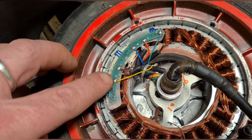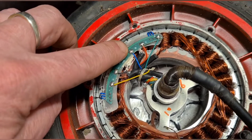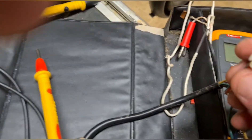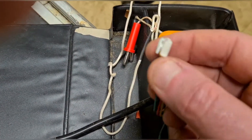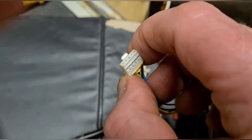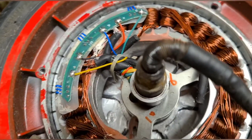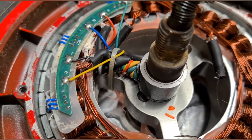Using the multimeter on these five data lines for the hall sensors — the blue wire should match up and give a signal when I touch the other side of it on this plug, but there's no signal through from that blue wire.